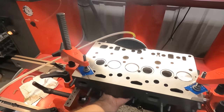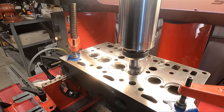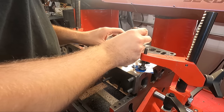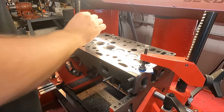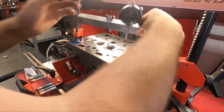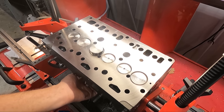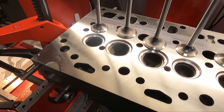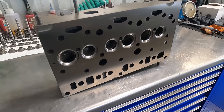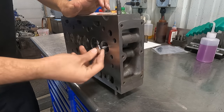As always we vacuum-check each valve as we go to make sure they hold vacuum, following the same exact process on the exhaust valves — just at a bit smaller diameter and to a different depth limit. While it is a bit more work than nice multi-angle cutting inserts, sometimes you have to make do with the tooling you have on hand. Keep in mind on the vacuum checks there is some amount of guide clearance so vacuum will tend to leak down the guide, but doing this day in and day out you learn what readings are acceptable — and this head passed the test. All in all we did some final cleaning and double checks, and the head was ready for assembly.